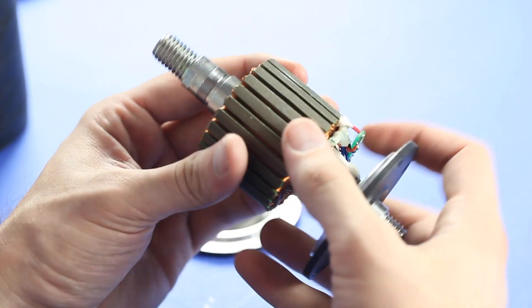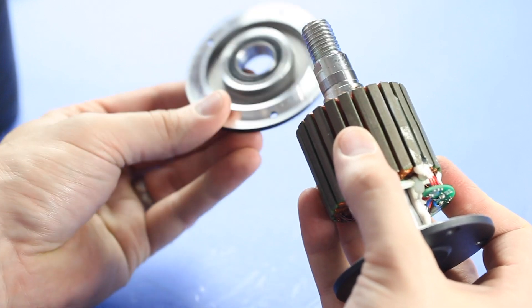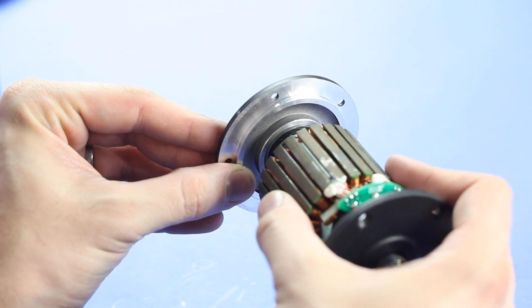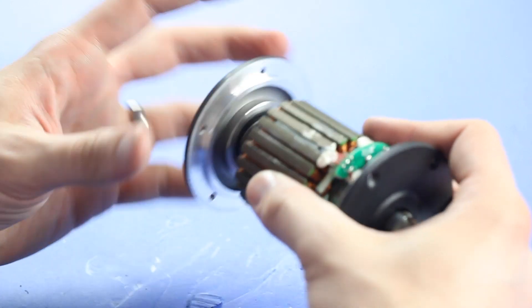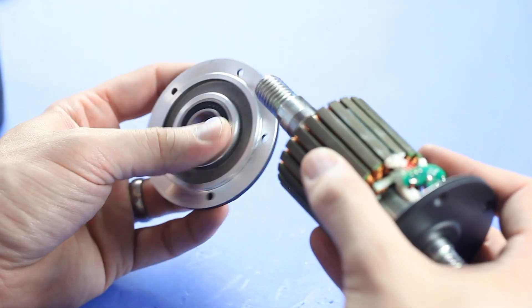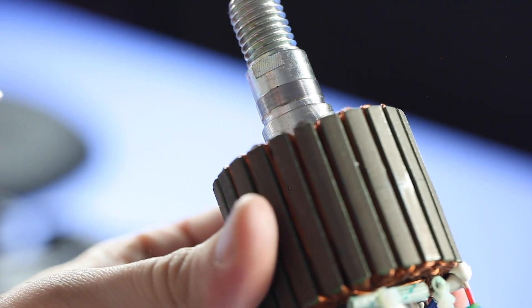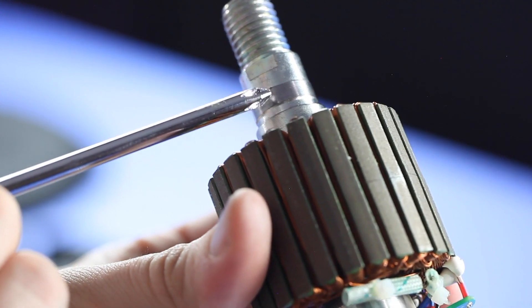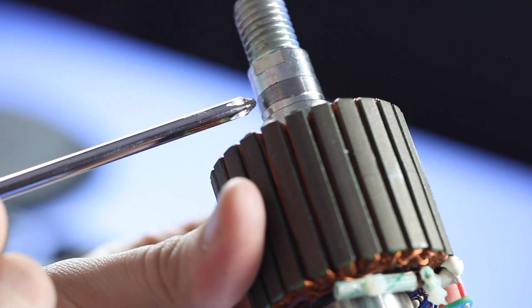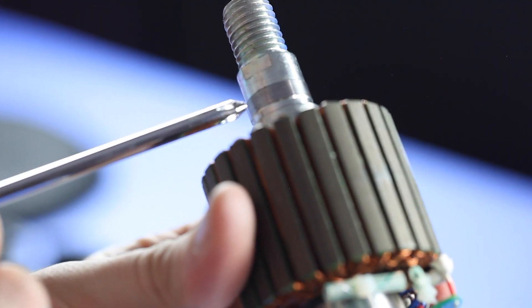This one certainly feels like it has been pressed on. As an ease of assembly step, this one is not pressed on and instead is a hand fit — probably a locational fit — to save some assembly time. On this shaft, which was made on a lathe, the bearing surface is nicely polished, or at least finished very finely. Everything else has been done very roughly where no one would see it.